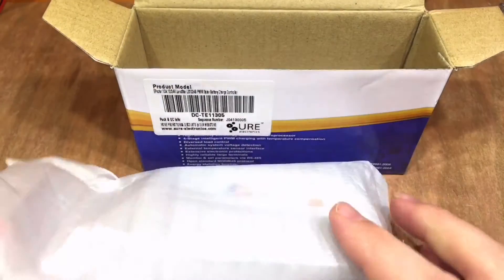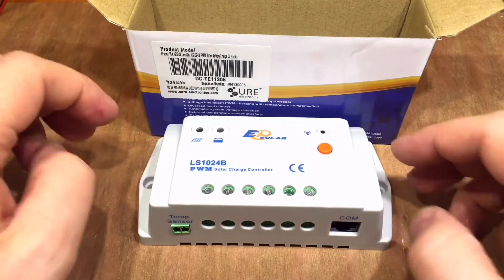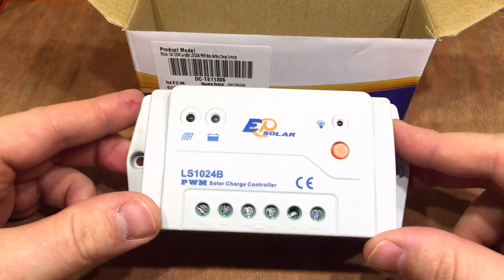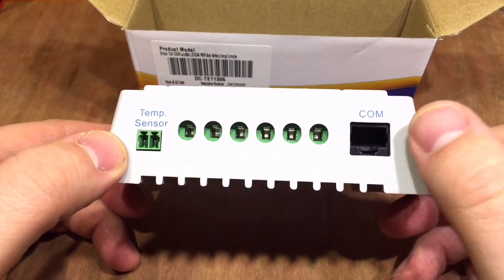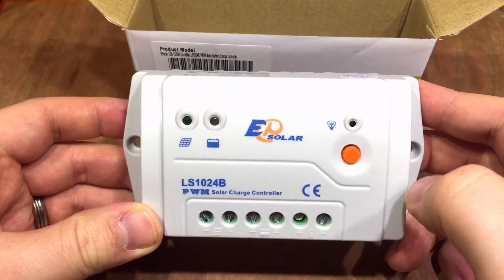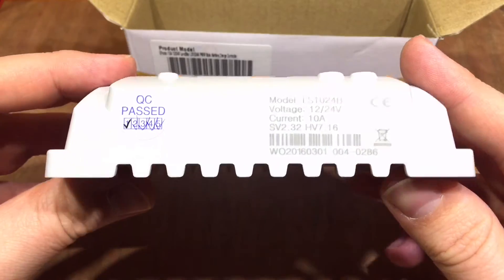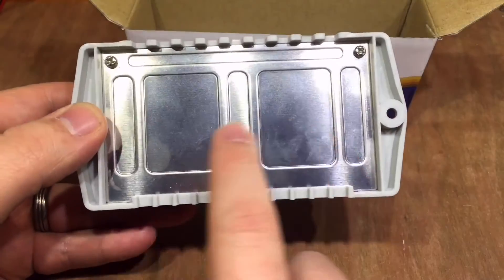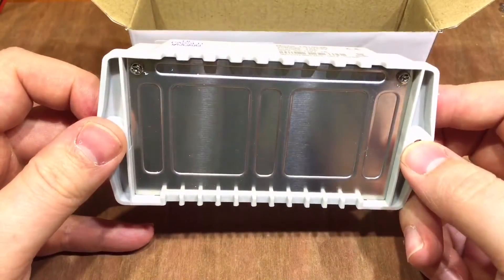The charge controller comes in a protective case — it's a fairly small unit, much the same as lots of the EPSOLAR charge controllers. This is the 10-amp version; there's a temperature sensor socket and a communication socket for the RS485. It's really simple with just one button, which presumably turns the load on and off. Model information is on the top and the serial number at the bottom. The main case is plastic but the back plate is metal, presumably where the MOSFETs are connected, with a little airflow available at the back to help cool them.